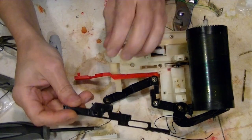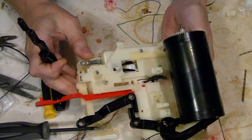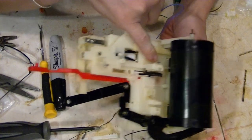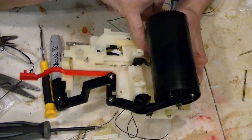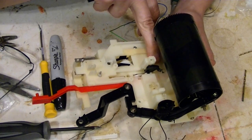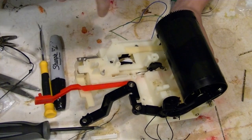Okay, here's what this piece is. That second gear system, the one right past the rubber gear, is actually that shaft right down there. It's on a spring. And when you push this down, it kills everything. All the gear system just stops because that's second in line. So nothing past that one is doing anything. That shuts down all of that.